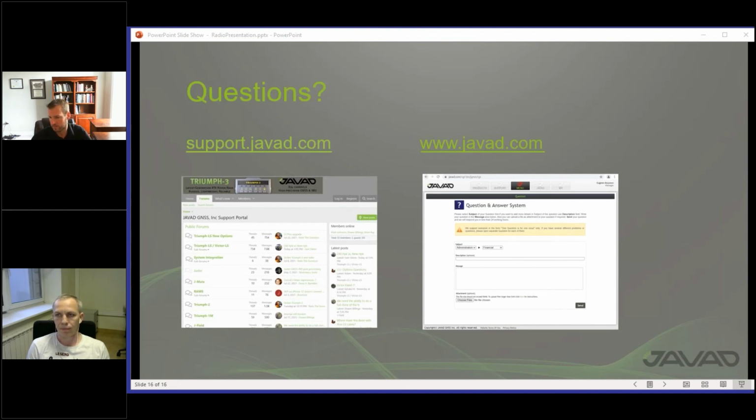When we use a 1 Hz frequency output, and then depending on how many satellite systems you're outputting would determine the modulation. It's pretty self-explanatory, the modulation and the configuration when you do base forward setup inside JField. So there's a format box, and then you have RTCM 3.0 and RTCM 3.2. RTCM 3.0 is just GPS and GLONASS, where you want to use RTCM 3.2 when you have all 4 constellations.